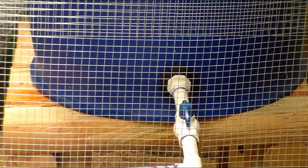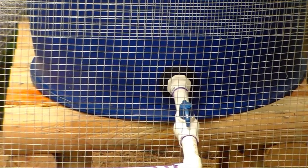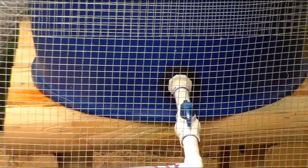Coming outbound from there, there's a couple of fittings to bring it down to three-quarter inch PVC pipe. And then there's a valve — it's just a ball valve, a shutoff. I think any system that's got water coming in, whether from a pipe or out of a barrel or bucket, needs to have a valve because you can't work on the system if you don't have a way to shut off the water. I've seen people with systems that have 10, 15, 20 barrels but no valves — if anything happens, you're going to have to drain the entire system.